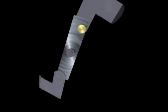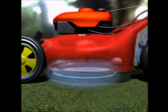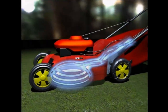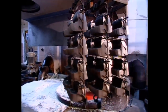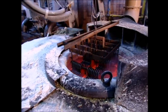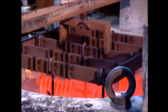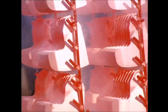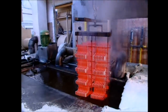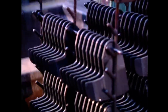Each mower has two blades screwed onto a central pivot, which spins at 2800 revolutions per minute — and this is where the wing comes in. The angle pressed into it creates a low pressure area beneath it as it spins. This sucks up the cuttings, which are spun around until they pass through the only exit route available to the collection tray. The job's done. But there's one safety measure the blade has to go through first — if the blade were to hit something solid, it could shatter, so they're all sent off to be hardened. First, they are heated to over 840 degrees Celsius for almost 10 minutes, then removed from the heat and rapidly cooled by almost 500 degrees. This quick cooling realigns the metal's molecules, hardening it — it's now far less fragile and more capable of hitting rocks, stones or forgotten garden tools without shattering.